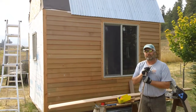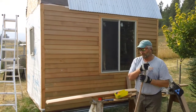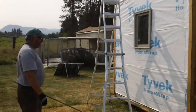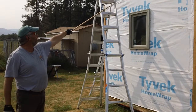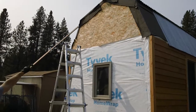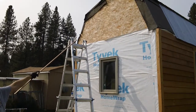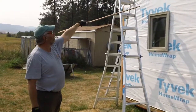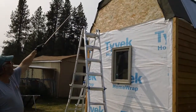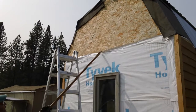Today's segment is going to be the Gable End project. I decided we're going to do cedar siding up the wall to the 8-foot mark at the top of the wall, and then above the gambrel roof line I wanted to do a contrast. So I'm going to use a kind of T111 type product that you can buy at any of the big box stores, facing vertically. This section is 8 feet across at the bottom and 4 feet high. We marked the center right here at 4 feet.